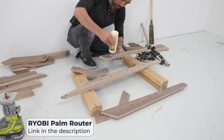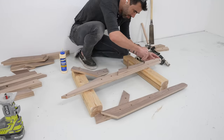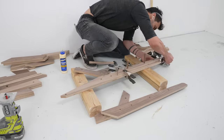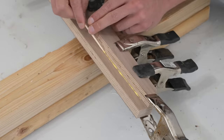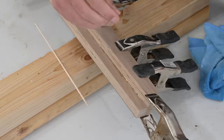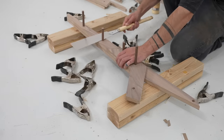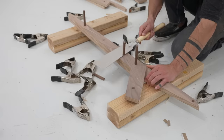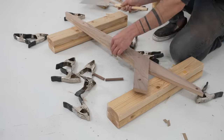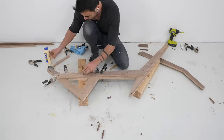For the second version of the lounge chair I added alignment holes that are half an inch in diameter so I can just put walnut dowels in them, which saves a little bit of time from lining up the pieces. I experimented with having the alignment holes go all the way through on one side but only about halfway through on the other so that you wouldn't see any penetrations through the walnut veneer. Trimming the walnut dowels adds an extra step but it definitely made the glue-up easier.